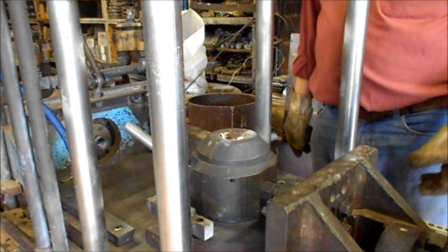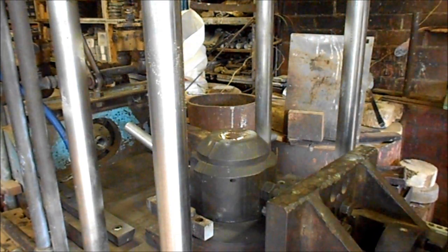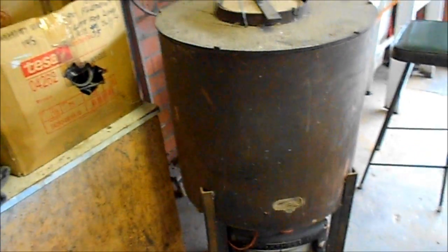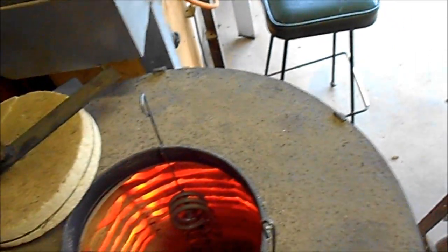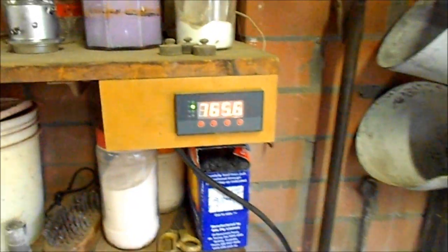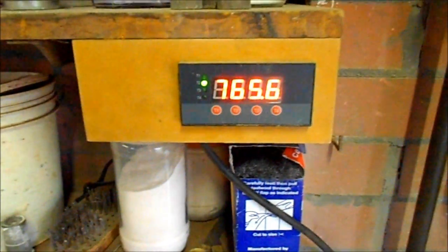I've got a little timer going again. Here's a close shot of the little electric furnace I use to heat the elements up. I've got it sitting on just under 600°C. The elements are just hung on wires inside there. For those of you who like looking at furnaces, here's the one I'm bailing out from — nice and molten, and it's actually sitting at 765.6°C, rather optimistically it says.